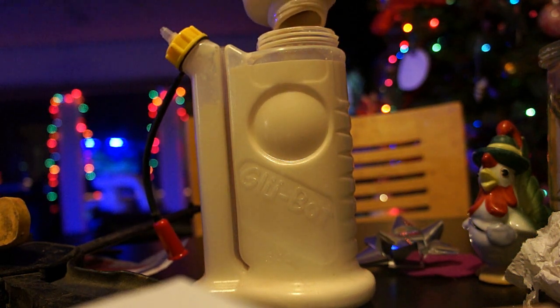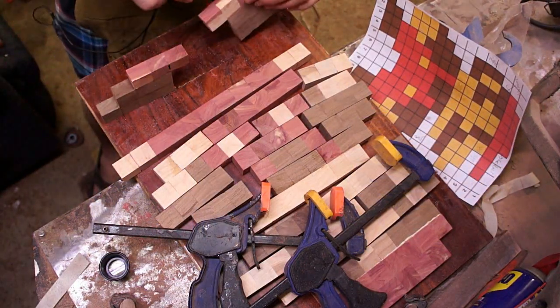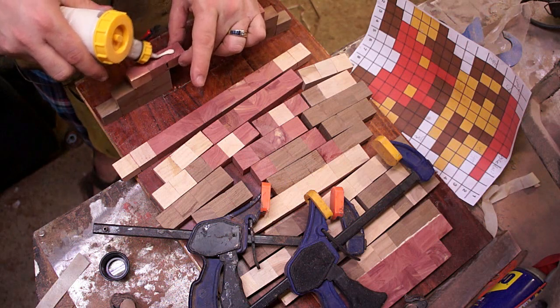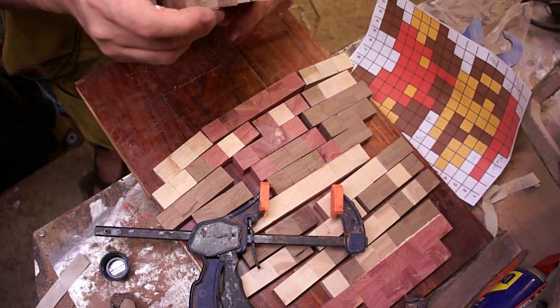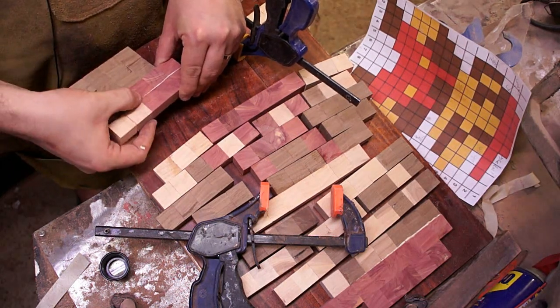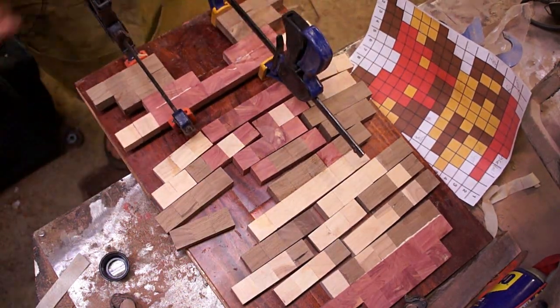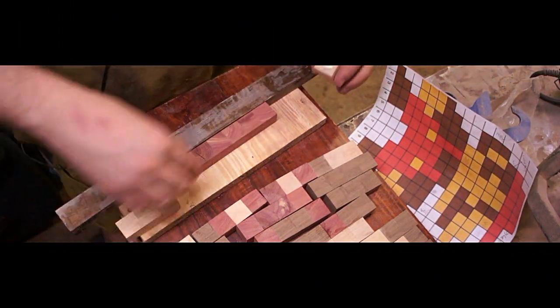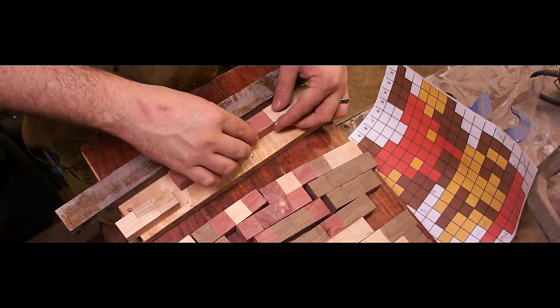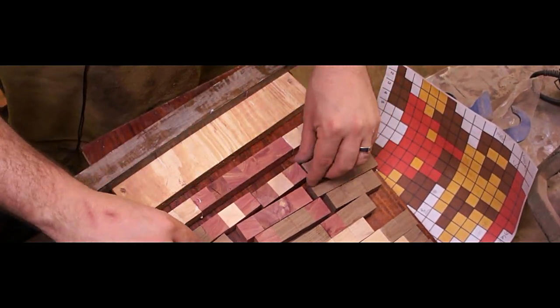I'd have to re-correct that. I think there's a couple of lines that end up a little bit skinnier — probably nobody else would notice. Here we're finally starting to go from all the horizontal sections to all the vertical sections. In a second I'm going to show you a jig I put together. I was having some issues when putting these long pieces together — they would curl a little bit because the edges weren't exactly flat. So I made up this little jig so I could at least get one edge flat and only have to sand on one side of these really long lines.